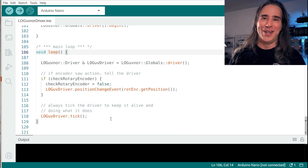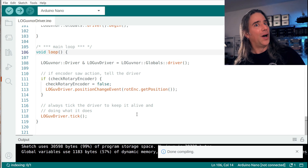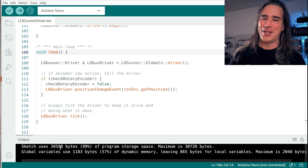Having that single point of entry means it's easy to wrap all this up as a library and then have a very simple Arduino sketch. I didn't bother wrapping the encoder up as part of the UI, so it lives in the sketch and you can switch it out for another library super easily. Here it is: just a library include, an object, and an ISR. Setup just takes the pin defines, does Arduino setup things, and attaches the interrupts for the rotary encoder. Then it calls begin on the driver, which inits everything inside. That leaves the main loop to just notify the driver of knob position changes and tick the driver. So simple. You've got a whole 122 bytes left over to add stuff.